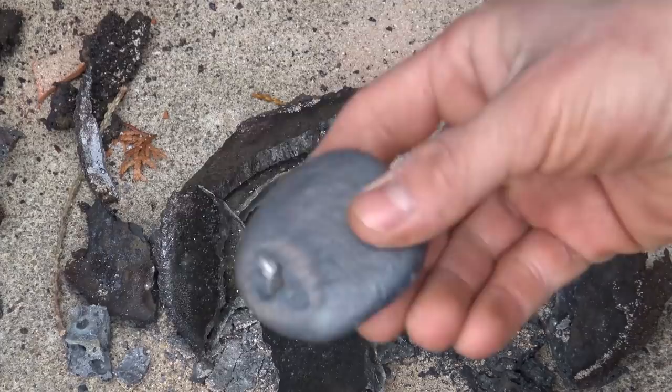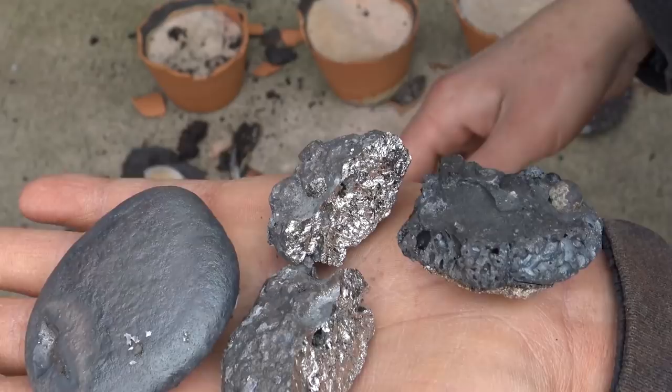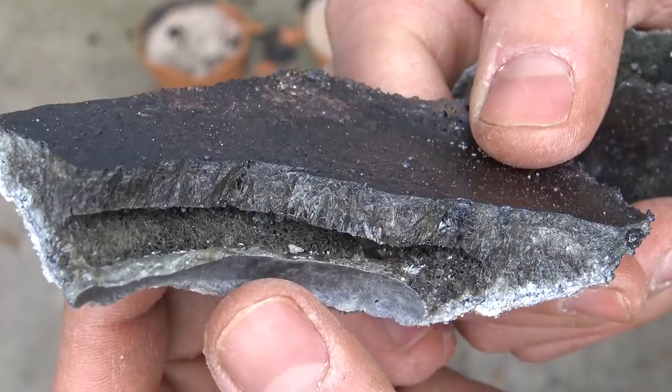Here in this shot is the metal from all three reactions. From left to right is black, red, and yellow. And it looks like we managed to grow some crystals. If I had to guess, these geode-like crystals are flux with iron impurities in it, as a similar growth pattern with different colors appears in other reactions.